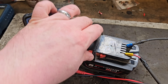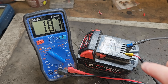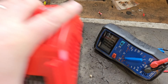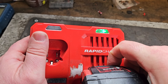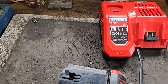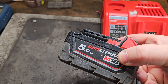Hello and welcome. Today we've got a Milwaukee M18 5Ah battery that won't charge, even though it's showing 18.7 volts. It's got one flashing light, and if I put it in the charger it's showing a fully charged light. But that's not okay because if you take it off it's still got the flashing light — the board has not reset for some reason, and more importantly it will not power a tool, so it's absolutely useless in its current state.